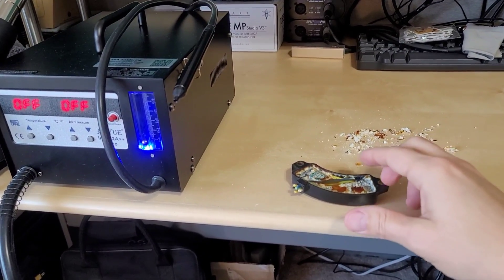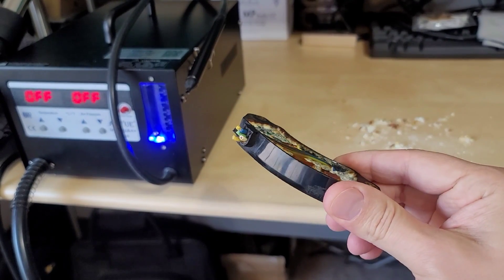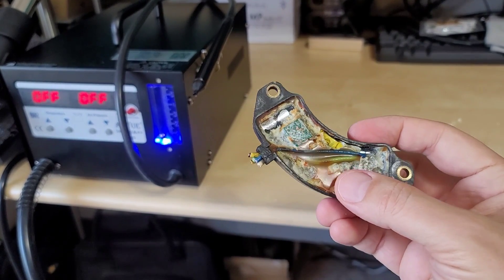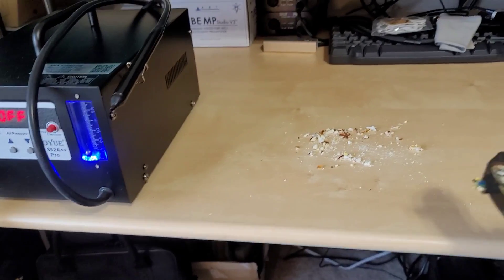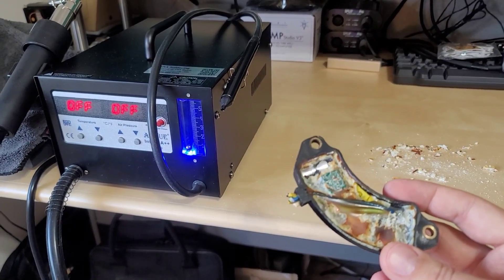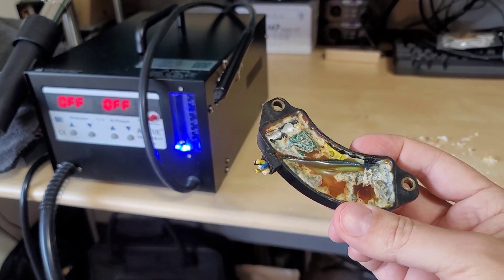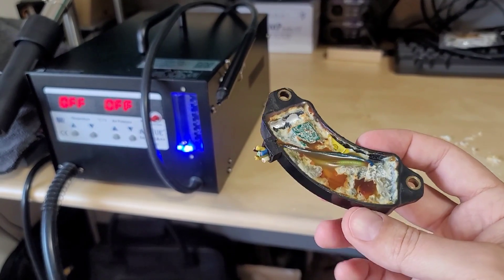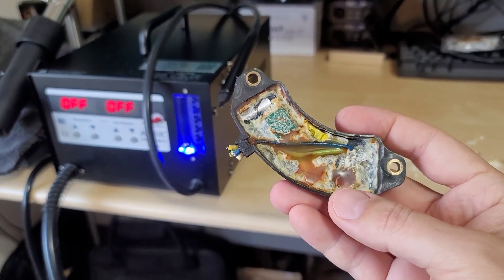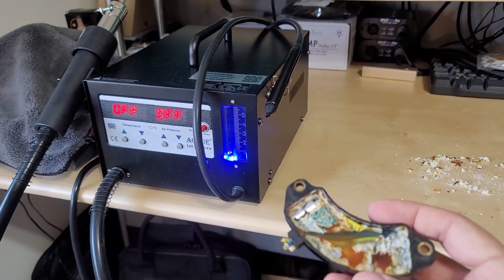I decided to do a little bit of work off camera before getting into the next segment — I do apologize — but I promise I will get the tripod set up in the next segment. I really wanted to find out at what temperature the epoxy starts to melt and become soft enough where I can start to pick away at it. As you can see I've already picked away some of it. Typically most generator boards I find it's anywhere from 350 to 450 degrees Fahrenheit where the epoxy will turn brittle and soft and you can start to pick away at it. But this particular one from Honda is not starting to turn that darker color, turn brittle and soft enough where I can pick away at it until my hot air rework station is at nearly 700 degrees Fahrenheit.